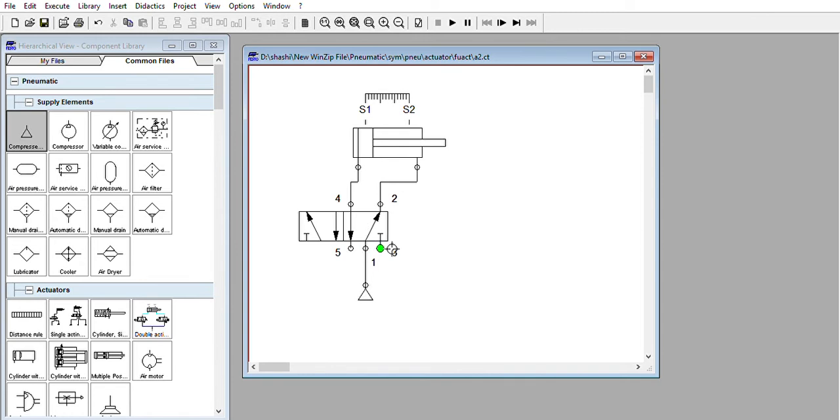This will be the opening to the atmosphere, through a circle port. You can change this port directly to open to atmosphere — select this type of port and click OK. Both exhaust ports should be open to atmosphere because the entrapped air will move through these. In practice, silencers are provided over here so that air will be open to atmosphere.